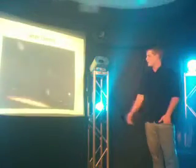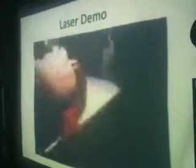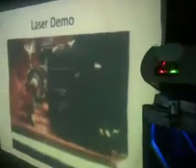The lasers you see in this video on the screen, this is actually one of them right here that I'm going to go ahead and take apart and show you guys how it works. It uses the theories of reflection very heavily and changes along the X and either Y or Z axis right there. Those two mirrors reflect the laser from the diode to create different patterns, and they're changing the angle of reflection pretty much dozens, hundreds of times per second without you being able to see.